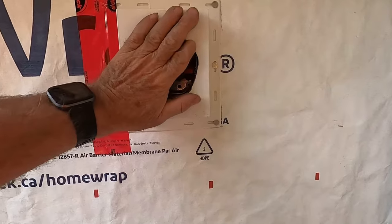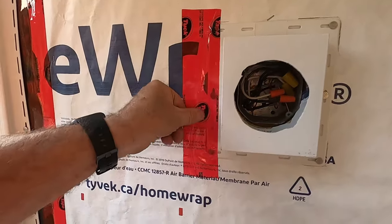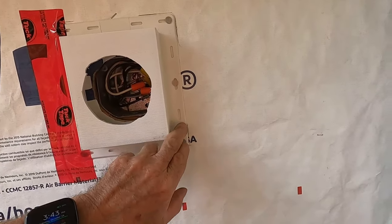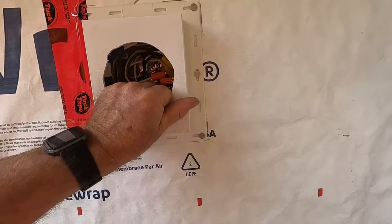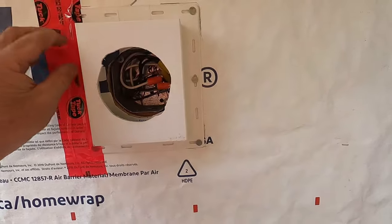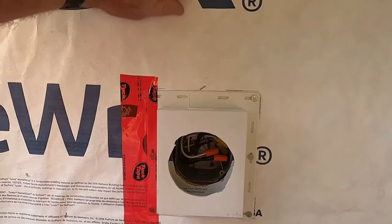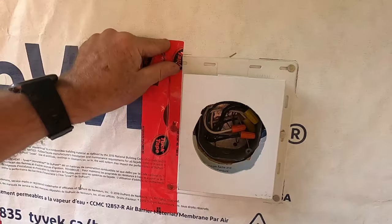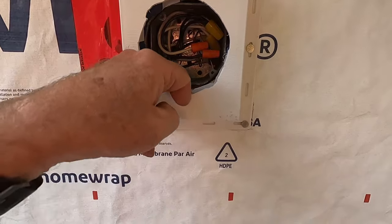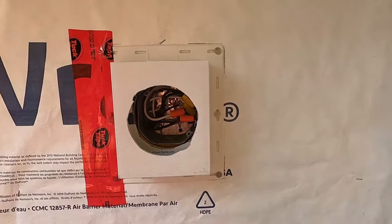This is the mounting block for the light. I've got one piece of tape on here, but you just nail it with the nails the same as you nail everything else. Now I'm going to tape around this three sides so that tape keeps any water that might come down here and sheds it onto the box, and I leave it open underneath so in case we get any water inside, it'll run out the bottom. That's all there is to that.